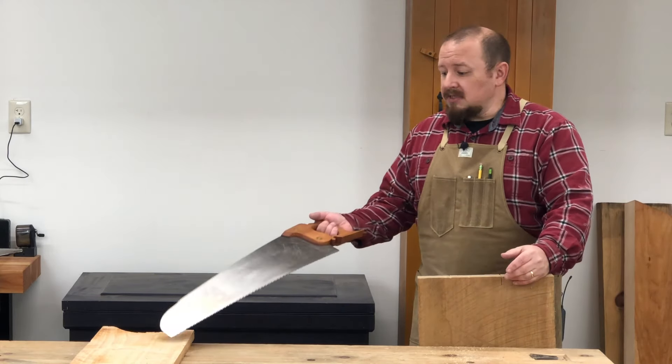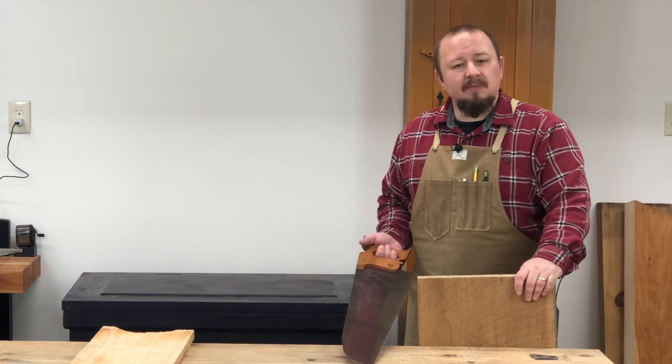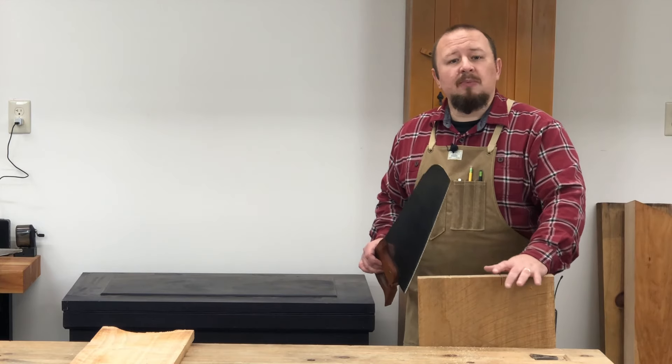So take a few minutes before we move on to the next video and practice this exercise. Start with a joinery saw or a crosscut saw and a relatively soft wood until you get the hang of it. Once you can do it in a soft piece of wood, move up to something a little harder like oak, cherry, or maple, and move up to a saw with bigger teeth. Once you can master the technique of sawing without sawing and starting the cut with a very aggressive large-tooth rip saw in something like white oak, you'll be able to start a saw very easily in any wood with any saw.